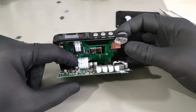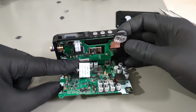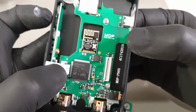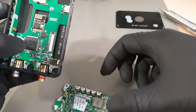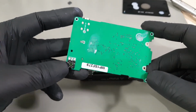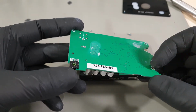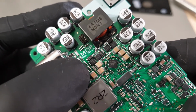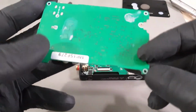I wonder if they are even ready to publish schematics for this thing, because this has taken some time to develop, I'm sure. Here's the relatively unexciting digital half, with a heat-sinking pad and a temperature sensor for that switch mode inductor. That seems to be their prime suspect in regards to temperature. The other potential hotspots can be found by looking at the placement of the thermal compound. It's the MOSFETs that are driving the inductor, of course, and a few more lonely transistors right next to the output.